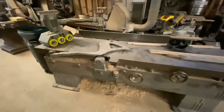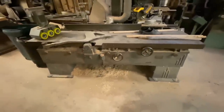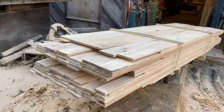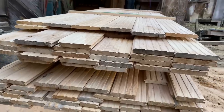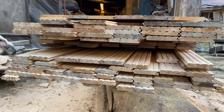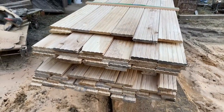Let's check out his jointer - he's got a power feed for it. This is a 16-inch wide jointer that appears to be about ten feet long - pretty awesome. This stuff is long, like 12 feet, a lot of it. We did a random width: three inch, four inch, five inch, six inch, and seven inch wide boards. Why? Because that's how you maximize the yield of the wood from its various widths, getting the most amount of coverage out of this pile of wood.